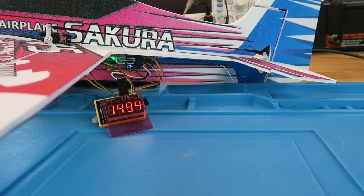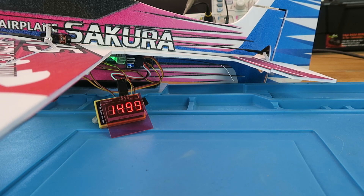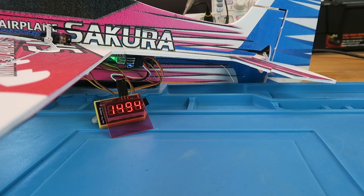If we look now at the elevator servo, which I've got almost dead-on 90 degrees, we can see the value very close to 1500. And if I move the elevator down, again it's about 100 microseconds away from maximum, but more than enough. And similarly in the up direction. So everything is working as it should do — I've been able to validate the output of the stabilizer. I hope you found that of interest.